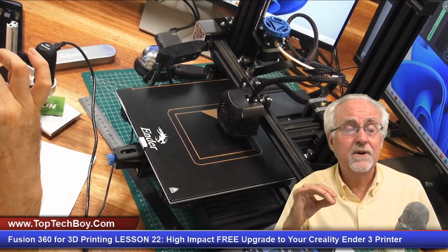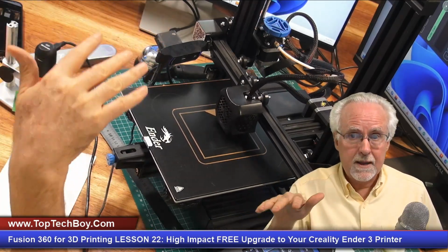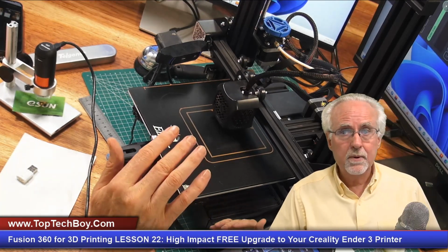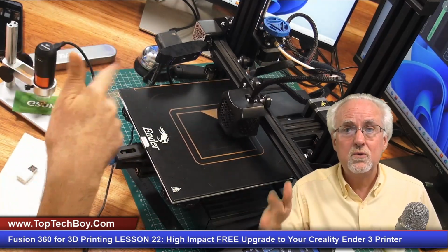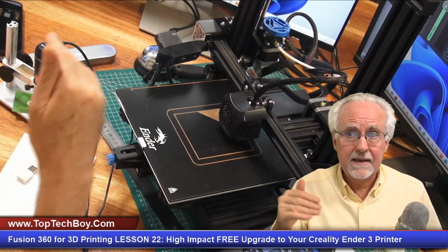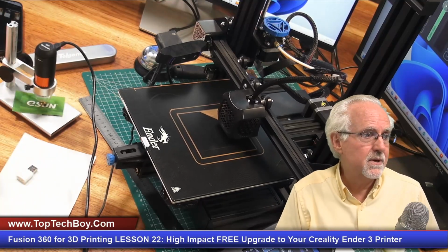So what have we learned? We've learned that if you upgrade your firmware to the firmware that I showed you, you can compensate for a print bed that is not perfectly flat. You can do it manually, and then those settings are saved to the firmware on your printer. So as long as you don't change it, you don't have to do that step every time. Every once in a while you can come in and do it if you want to, but what I found is I can do multiple prints without having to re-normalize or create a new mesh. Okay, that is just absolutely pretty cool.